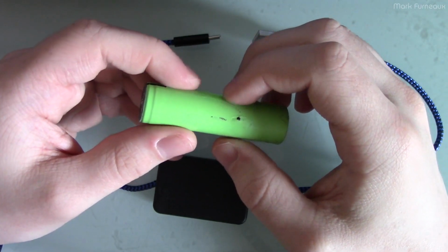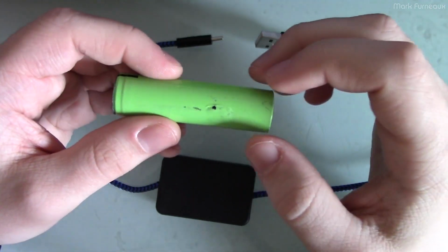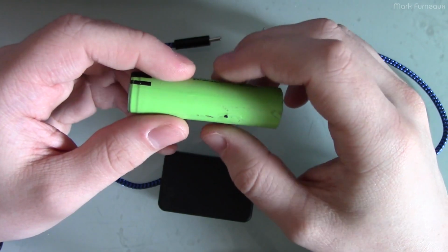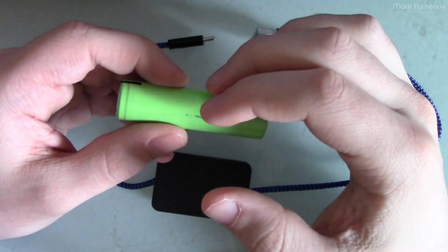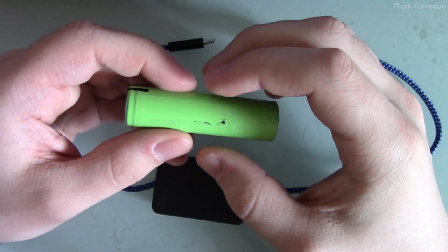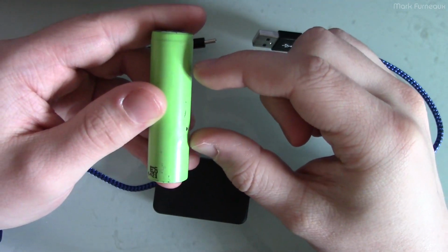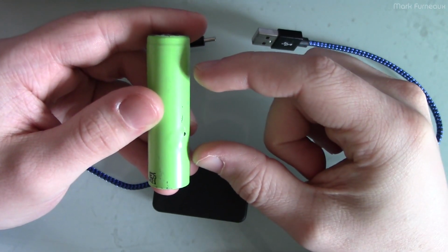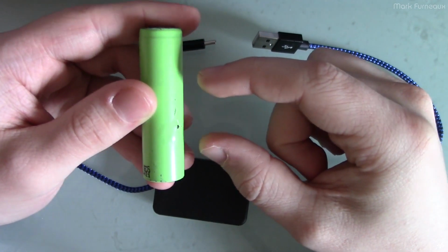So the first thing to note is that lithium batteries do not like to be fully charged, and they don't like to be fully discharged. If we're anthropomorphizing, they basically just don't want to exist at all. But since that's not really an option, they would prefer to be about 50% charged. So it's commonly accepted that if you use it between 80% and 30% state of charge, that is the easiest range on the battery.